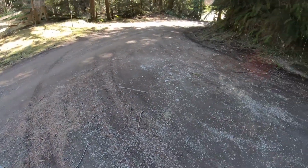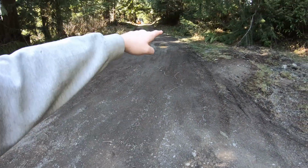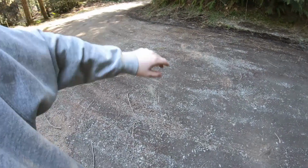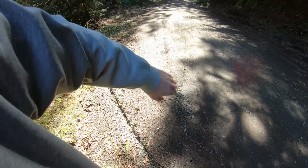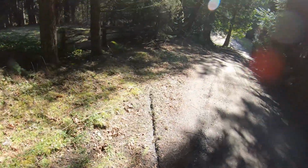And it doesn't seem to be eroding it much. But it is forming these potholes here. And so if I can just get a ditch that'll take the water to here and then just transport it over the surface to that ditch down there. And also this road here, there's no ditch here, so the water, you can see someone's tried to scrape it and make something here, but it's just not enough. And so the water flows across the road and creates little potholes and stuff. So I'll come in here and dig this out a little bit so that we get the water just to flow nicely down and not down our road.